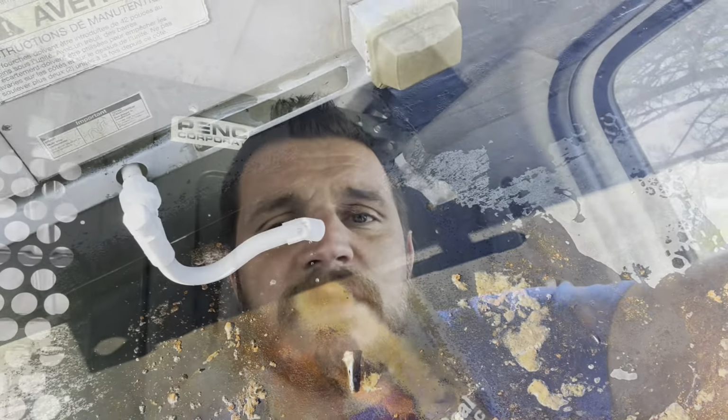Yeah, guys, so really important to keep your drain pans clean also. All that dirt gets built up in there and it goes into the trap and usually stays there and gets clogged up. Make sure when you're cleaning your drain lines and your traps, you clean the drain pan also. Most of the time, it's pretty simple to get to it also. Just take off a couple blower door or filter door. You can usually get right to the pan and get it clean.